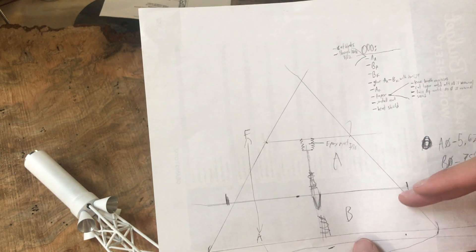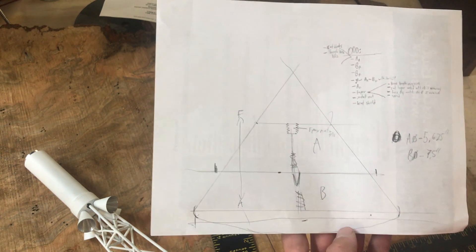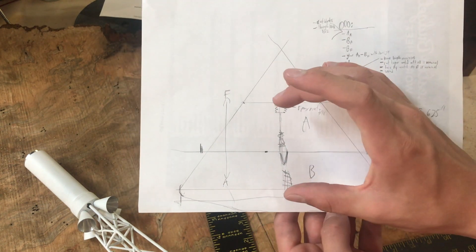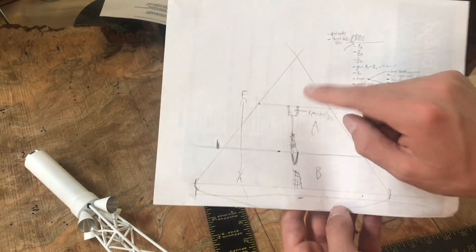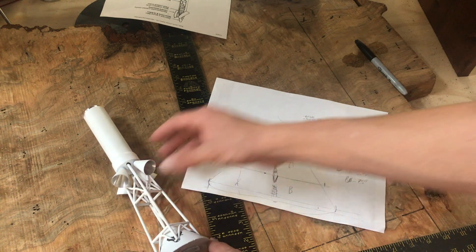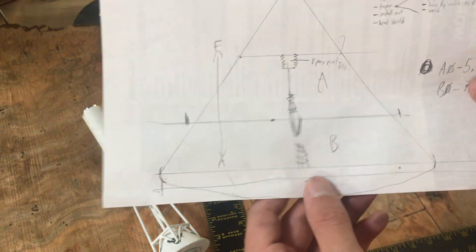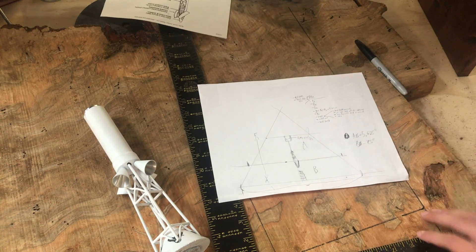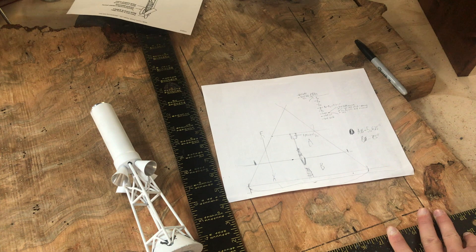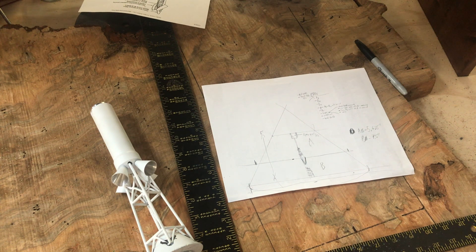I'll throw it on the lathe, clean up the faces, and there'll be a tiny through hole through the whole thing so I can put a wire through, make a little jig, and then glue it all together. I'll make the two round bits, glue them together, then come back, cut the tapers, and epoxy in a nut right there where the launch escape system will be able to screw in. Similar thing with the heat shield - I'll carve it out and then glue it up into the bottom, and then sand it all. I'm going to try not to talk too much more in this video - basically you're just going to see the building process. If there's anything that needs explaining I'll explain it, but for the most part enjoy.